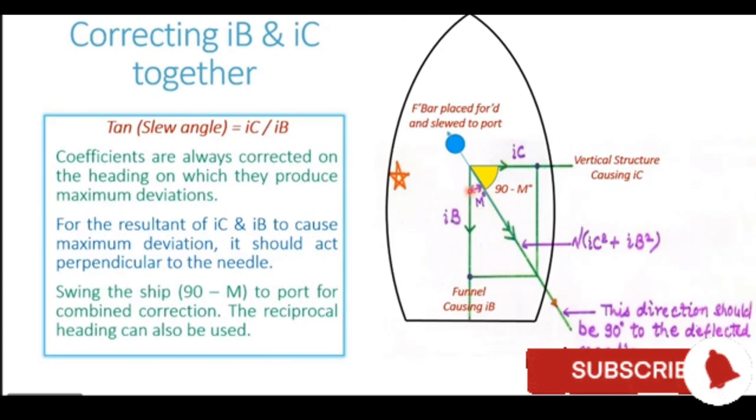Now we know tangent theta is equal to perpendicular upon base. So tangent of this angle M will be equal to the perpendicular. You can see the perpendicular is basically the IC component, and the base is the IB component. So tangent of this angle will be equal to IC upon IB. So you can see the formula here. Tangent of the slew angle is equal to IC upon IB. So if we know the magnitude of IB and IC, then we can easily calculate the slew angle. The slew angle, once calculated, gives us the information how much turning or slew is required for